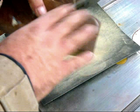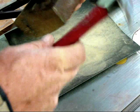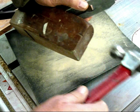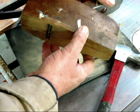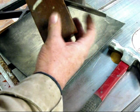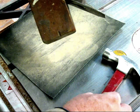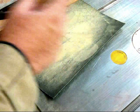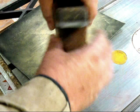I thought I'd show you how to remove an iron from one of these old planes. Grasp the iron and the wedge, then you strike on the rear and it comes out. You adjust the plane blade as needed and tighten slightly. There's a slight hook here at the end of the blade from tapping it — that's to increase the depth of cut, or adjust the depth of cut from side to side, so that you get an even cut on both the left and right sides as you're smooth planing.